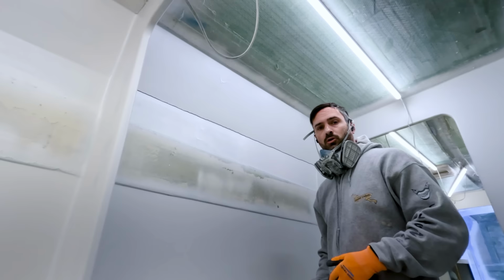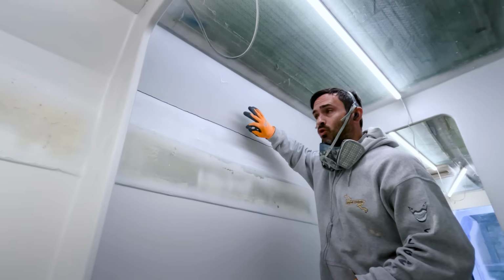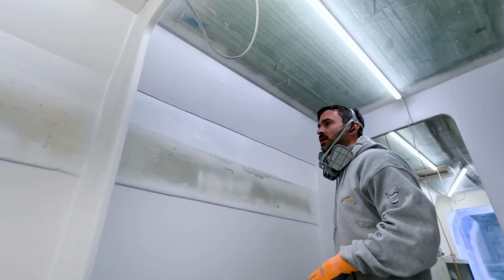When I'm sanding with the dykem on there, it's very hard to see actually where that line is. And I want to make sure that I don't run against it or on top of it. So let's put a quick mark there. Then I'll put the dykem on, and that should give me hopefully a guide so I don't disrupt that even more than it already is.